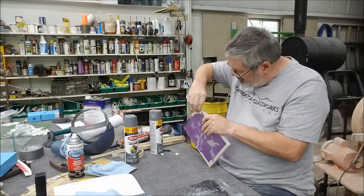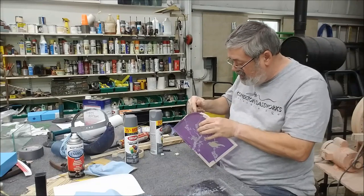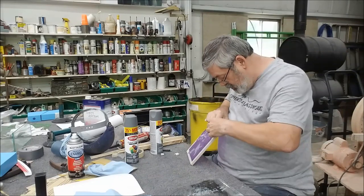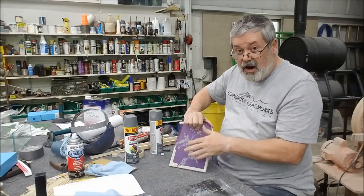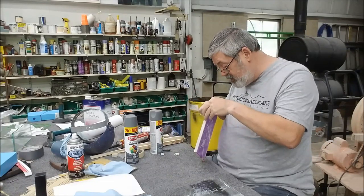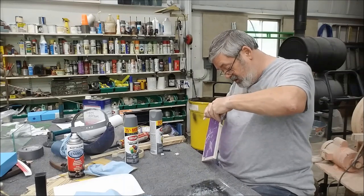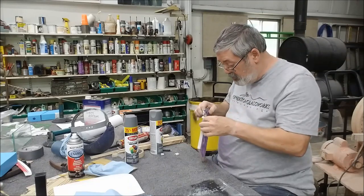A lot of times when you're peeling your photoresist stencil off, it's very sticky and very tedious to get it all off. Now, if you know you're going to be doing some light blasting, like for the secondary stencil, we did some very light blasting, very low pressure. So what I did was I left the stencil in the dryer a lot longer than otherwise I would have. If you let it over dry, it can lose some of its stickiness and it can blow off while you're sandblasting.